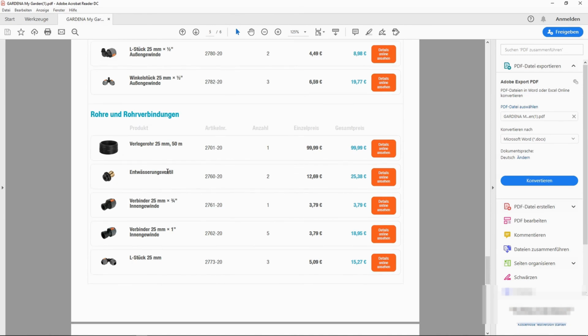The drainage valve here is suitable when you can accommodate a slope overall, to then drain it completely in winter so that no frost gets in there. I generally refrain from such valves for my part. I just see a much too large issue with them. There is a risk that they will break and run empty permanently, or break down by getting clogged. Then dirt gets in and they cannot open.